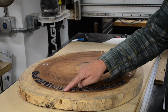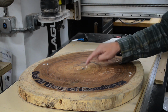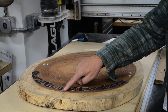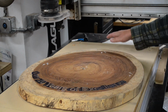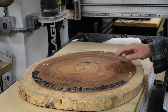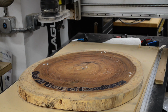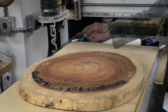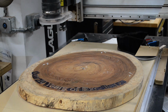And since this is the high spot and this is the actual semi-high spot, this is 1.7 millimeters less than this one, and I'm usually going to try to take off about 1 millimeter at a time. And so it's going to be a manual process. It won't be real fast, but I'll have full control, and that's what I like to have. I'm using a surfacing bit that's 2 inches in diameter from a company called Rip Precision Tools.